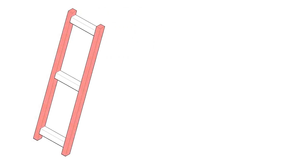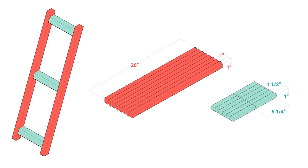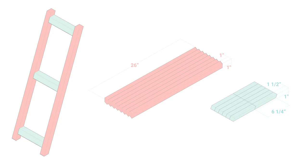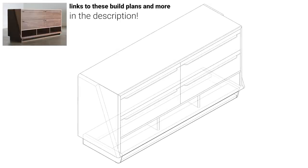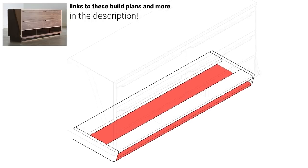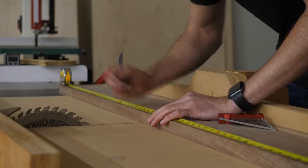The base is essentially made up of two pieces: longer skinnier leg verticals — I need eight of those at about one inch wide, one inch thick, and 26 inches long — and shorter wider slat pieces about an inch and a half wide, one inch thick, and six and a quarter inches long, twelve of those total. For the legs, I grabbed a chunk of wood that had some domino mortises cut into the ends — this was an oversized leftover from when Sean was building a dresser. As luck would have it, it was almost exactly the right size for my eight legs.